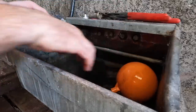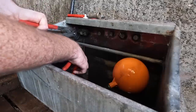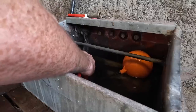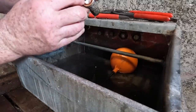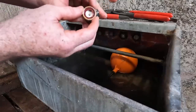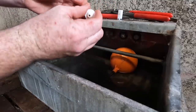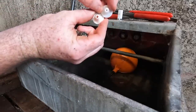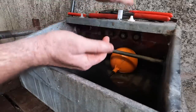That removes our ball valve. Loosen, it'll pop you. Here we are. See what's sitting there? That is a stone right there. And you see how, where the hole is all opened up? That's what it should be like here. You can see that one's all pressed out, so that is our problem right there.